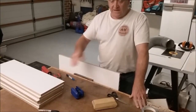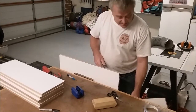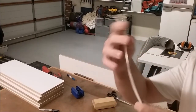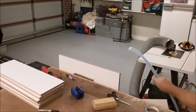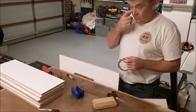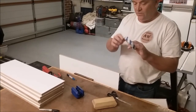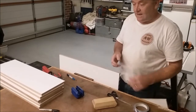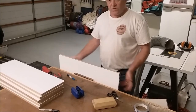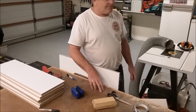That's all the panels cut for the front of the drawers. Next thing is to do the PVC edging. Actual edging, not pre-glued, it's PVC, very flexible. About 3/4 of an inch wide. I use Fast Cap speed tape to put it on with. Basically it's double-sided tape. It's very thin, about 1/2 mil thick or even less, I think. Extremely sticky, really holds on well. The way I do it is I apply the tape to all 4 sides of the panel, then put the PVC on, and then trim it off on the router table.